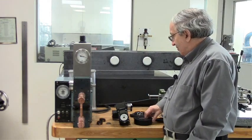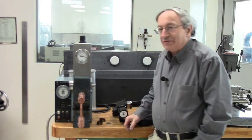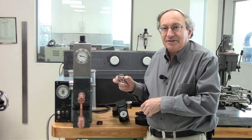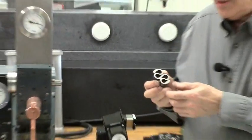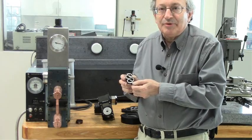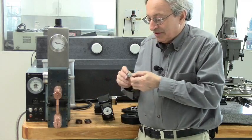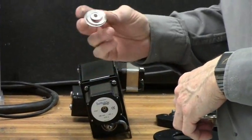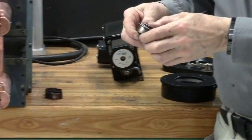Here are a few more examples of what you can fabricate using the methods shown in this course. A very simple thing you can fabricate on a water jet is springs — all the way from springs carved from solid steel, which can be cut from hard material or cut in the annealed state and then hardened. These are springs which need a few hundred kilos to compress; if you wanted to wind them from wire, the wire would be the diameter of a pencil, making them very hard to wind. You can also make very nice disc springs like this with a spiral.